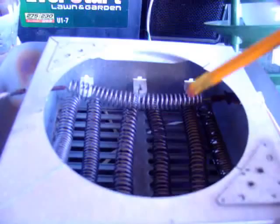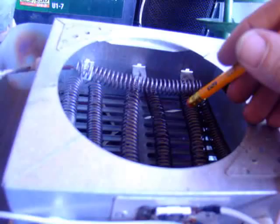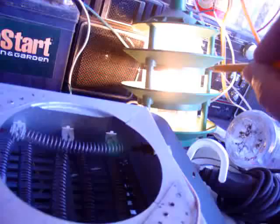Not that great. And when you put them all in series, I've got 12.2 ohms going through the whole thing, which gives me 0.98 amps. That's not very good either — 0.98 amps times 12 is right at about 12 watts. That's even lower than 13.56. But just using this element alone at this length will give me 84 watts. That's almost two of these 50-watt bulbs. That's not bad.